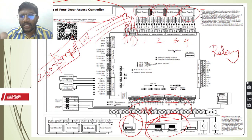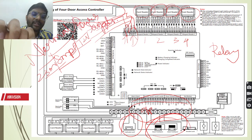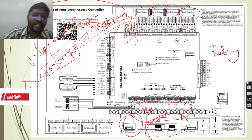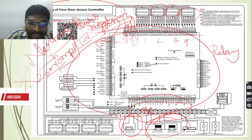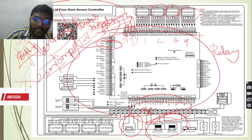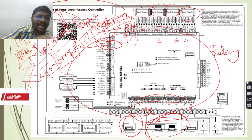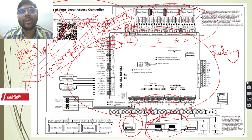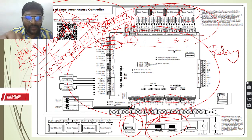Now we are provided with normal power supply. Consider a scenario where this power supply is failing. In such occasions, the system has to work properly. For that, we need to provide a battery supply - you can use a 12-volt battery. Connect the negative and positive terminals here so that even if the main supply fails, with the help of a battery this equipment will keep operating. We can't say that if main power fails we can't enter or exit the building - it should work 24 hours. So in such occasions we need the support of those batteries.